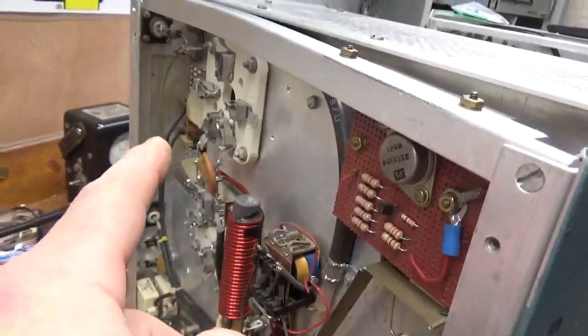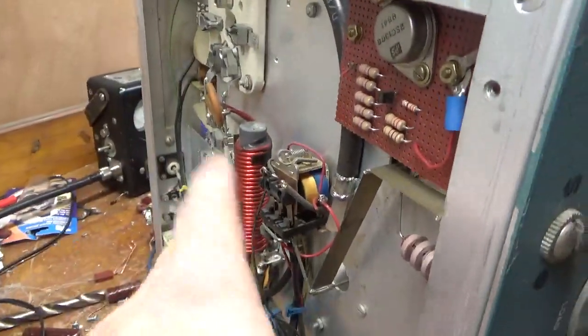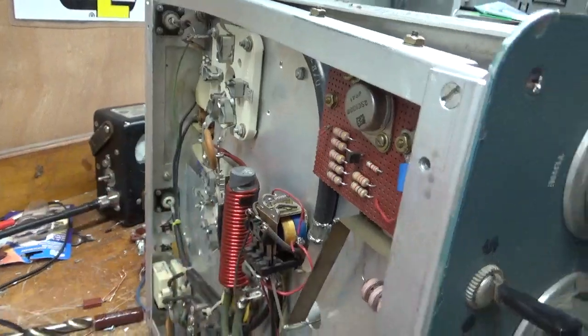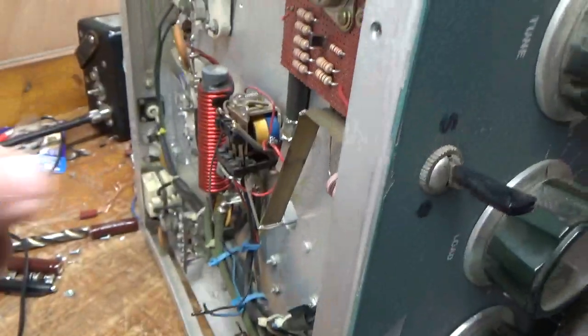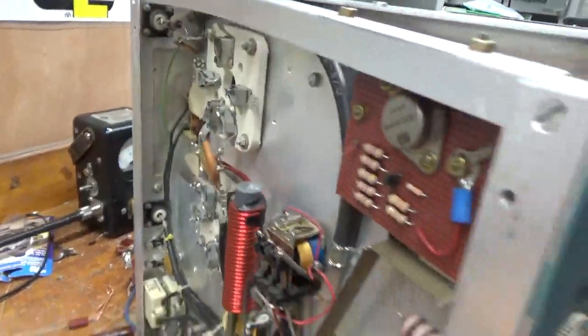The customer already has an ARB box from Ameritron. I already removed the two chokes and capacitors and drilled the holes to ground the grids, so I'll ground the grids. There's also a bias modification I need to do, touch up on solder joints, and I'll reconnect the standby/operate switch.